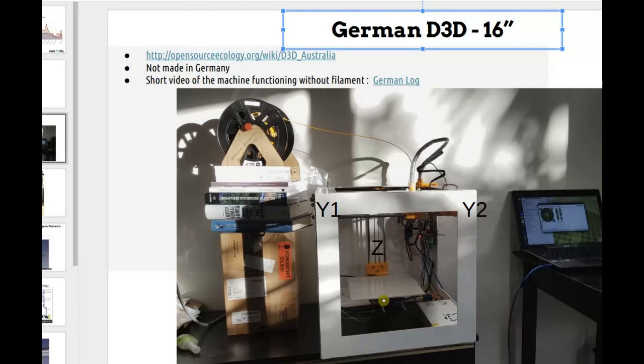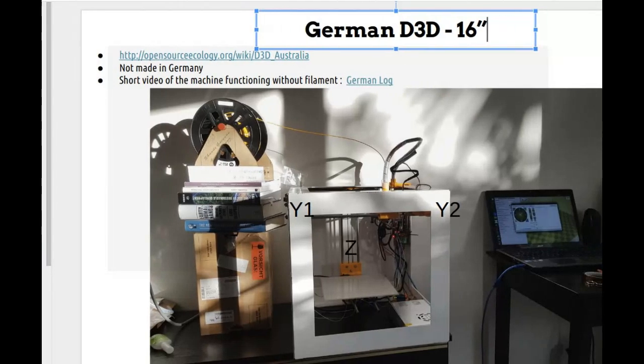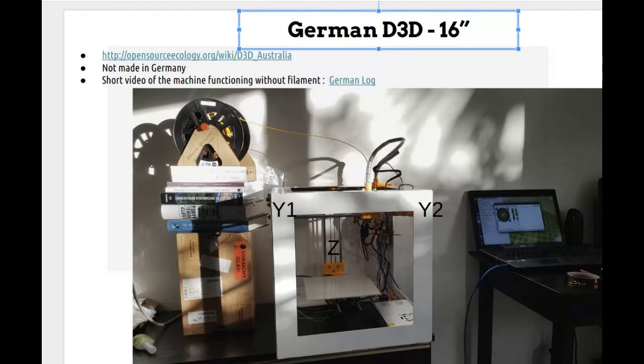Yeah, no, I think it is a good idea. But what I have noticed here with the piece on the X carriage and on the Z carriage, sorry, that short idler piece that we use to hold the bed rods, there is an issue. The force put into the piece by the nuts that hold it to the carriage splits that little short idler piece open. I think that is our main issue in relation to the drooping of the bed: the nuts start digging into the back of that short idler piece, not because it's getting hot or anything, just because the plastic starts yielding with time. It's just the nature of the material.